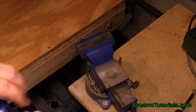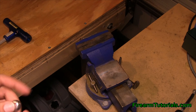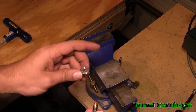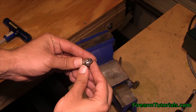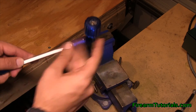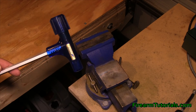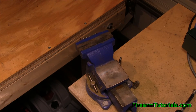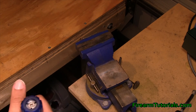I haven't actually showed a video of how this thing works, so I'll just do it real quickly. This isn't the best tool for this, but it gets the job done. So it comes with these little collets, a couple different sizes. You basically put them in like this and then it's going to grab the actual end of the case there, and we screw it in this little thing here till it's tight and then we smack it and the inertia is just going to unseat the bullet. So once we're done, we'll have an empty case, the bullet and the powder. Took two hits.